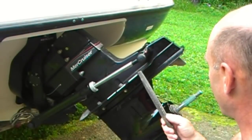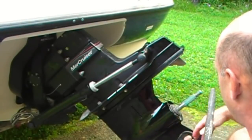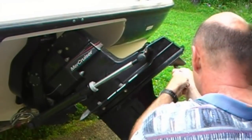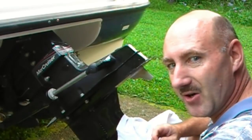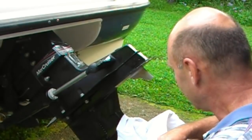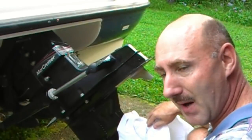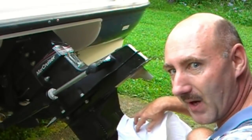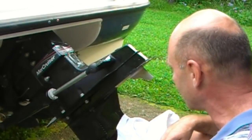I've got a large rounded file, and I've got my foot wedged against the skeg for support. I'm almost done with the notch. One thing I noticed — and savvy mechanics will have thought of this — is that filing creates metal filings which were falling down onto my prop shaft. I've since covered that cavity and prop shaft, cleaned it all up, and I'm going to do a double check for metal filings. The last thing you want is metal filings on your prop shaft.